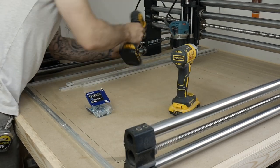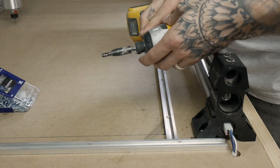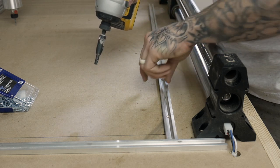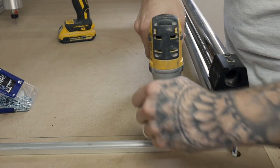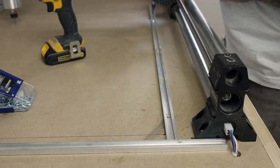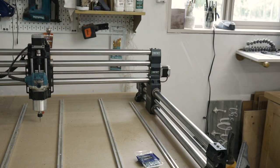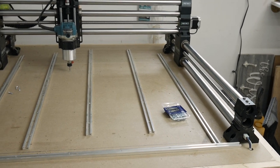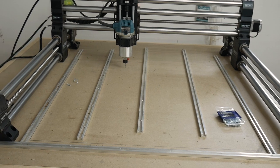The reason I'm using two drills is I'm using a self-centering bit just to pre-drill all the holes and make sure the hole is in the center of the countersunk hole on the T-Track. I'll add a link down below. These are made by Bosch and I've had these for a few years now and they're still going strong. Quick recap: we had the front piece butted up against the front for reference — not locked in yet — and both outside pieces are locked in.